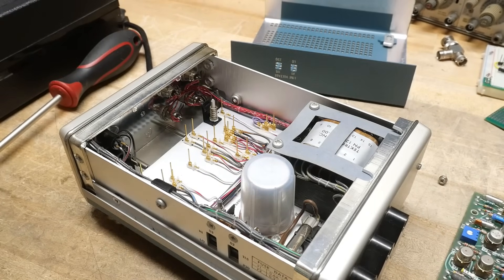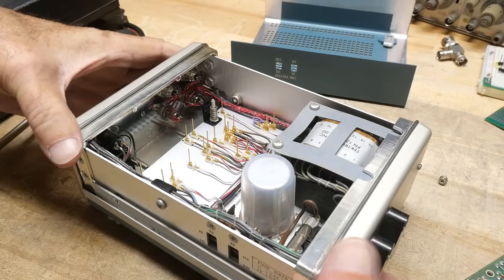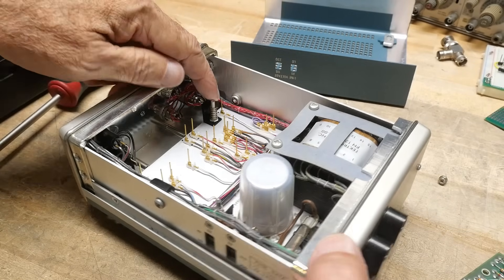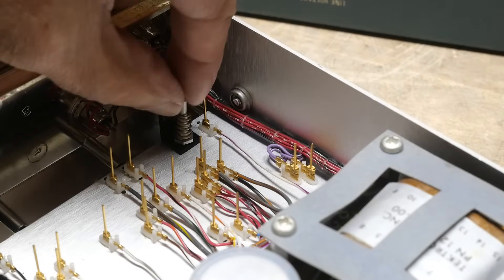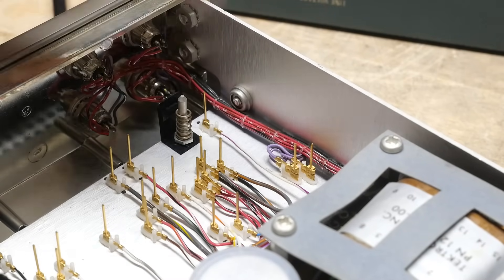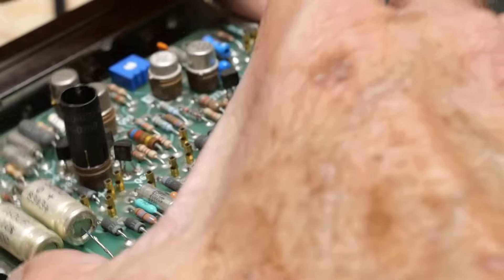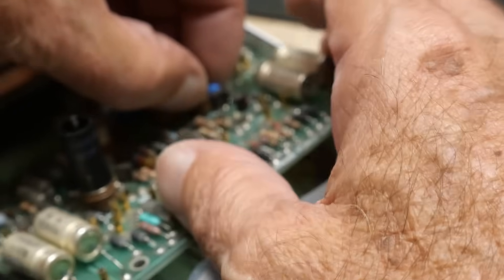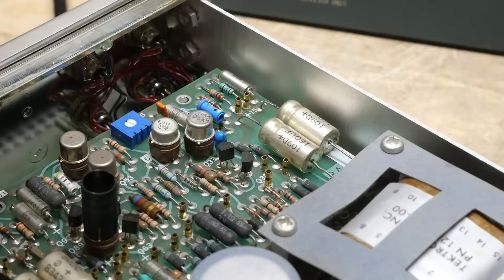My mind is blown. See the PC board? It registers on some posts. You can see that post there — it has a spring on it. The PC board comes down and sits on that spring, and you push it down until that latch makes it go in. There are three posts. You have to be super careful, otherwise you're going to bend those little delicate gold things.